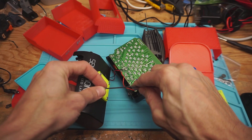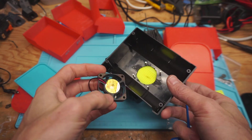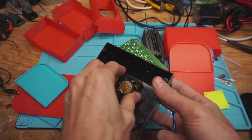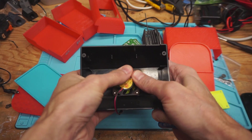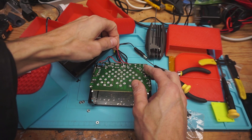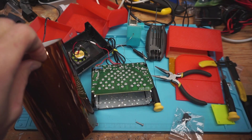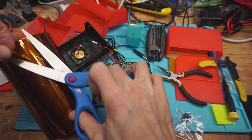Now it should actually have some UV protection on there. I wasn't sure which way I'd want the air to blow — whether to suck in cold air from outside onto the top of the board, or to suck air in from underneath for cooling. On putting it back in, I damaged the fan cable — I should have used a more flexible cable, but live and learn. I'll reattach that and re-solder both joints, then strap it down with a bit of Kapton tape to provide some strain relief.